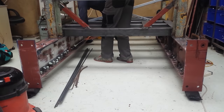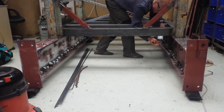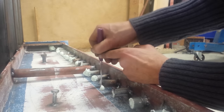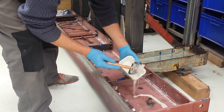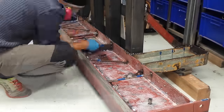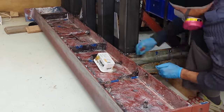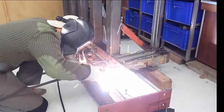These small stubby bits of pipe I'm filling with expanding foam — perhaps this epoxy bonding coat will give it away. It's a mix of one part fast-set epoxy to one part anti-slip grit designed for flooring. I think sand would have worked just as well, but it's what I had.